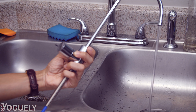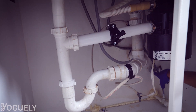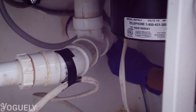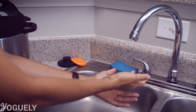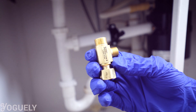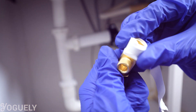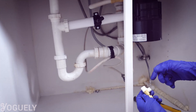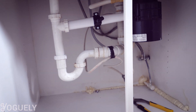This faucet is only to be used with cold water, so I'll connect the reverse osmosis system to the cold water supply. First, turn off the cold water valve — the lever aligned parallel to the line means water is flowing, so turn that lever 90 degrees so it is perpendicular, then open the faucet to test that no water is flowing. Disconnect the flexible connector pipe that attaches to the cold water valve. This brass max adapter will redirect the water line both to the sink and to the reverse osmosis filter. Prepare the brass max adapter by applying white plumber's tape onto the threads to create a tighter seal and prevent leaks, then thread the adapter onto the cold water valve using the bottom female thread.